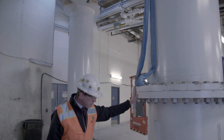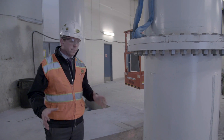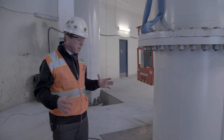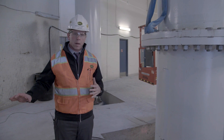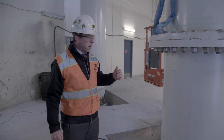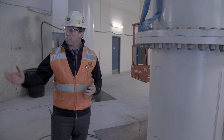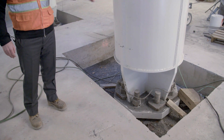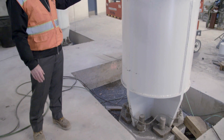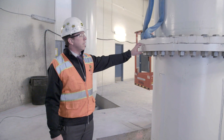Below grade, these massive super columns are supported on foundations — and these aren't traditional foundations like a drilled caisson or a large concrete pad. These are actually a series of micropiles. There are somewhere between 50 to 70 micropiles supporting these three columns. The micropiles are drilled with small machines that can enter through basically a garage door, drilled seven meters down into the ground at varying angles. You can tell from the sheer size of the columns that this is some serious steel supporting some rather large loads.